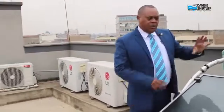We have various sizes of these systems depending on usage, both for domestic and commercial application. We have three standard sizes: 150 litres, 200 litres, and 300 litres. Based on industry regulations of 30 litres per person per day, the 150-litre system is sufficient for a household of about 5 people, the 200-litre for about 7 people, and the 300-litre for about 10 people. We also have a commercial range for hotels, gyms, schools, and other large applications, and we conduct free sizing surveys to advise on the right solution.